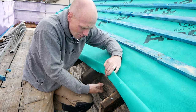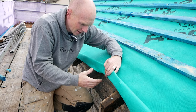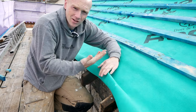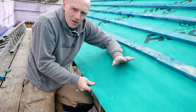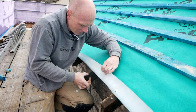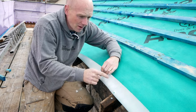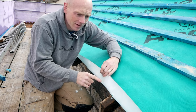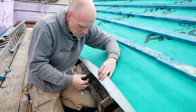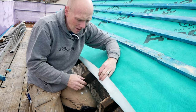So you extend the rafters on the inside to achieve a greater U-value. In this case, we've got 100mm between and then 50mm on the inside of the rafters in the living space. And that's fine, but it means if you're still needing to keep that 50mm clearance here, you're basically losing out on a whole load of insulation space. The benefit of this is you can reduce that 50mm gap. So in our instance, it's probably closer to 25mm, 30mm. And that was a bit of a concern at the time, and that's how I came across this product.